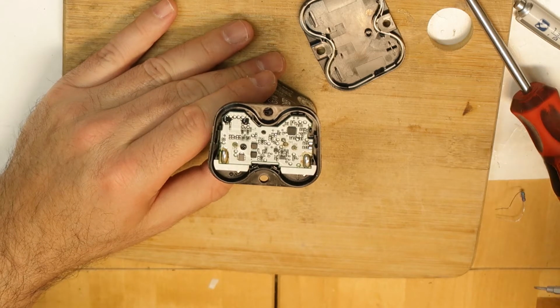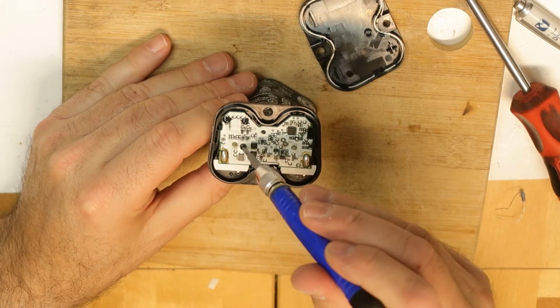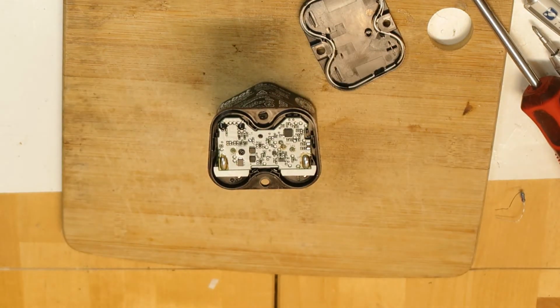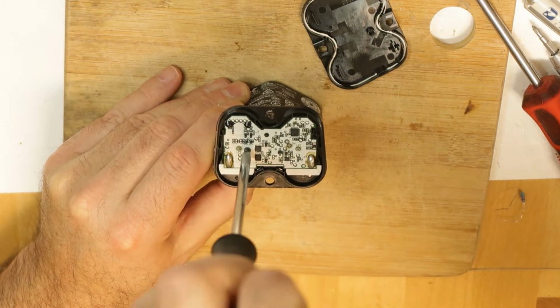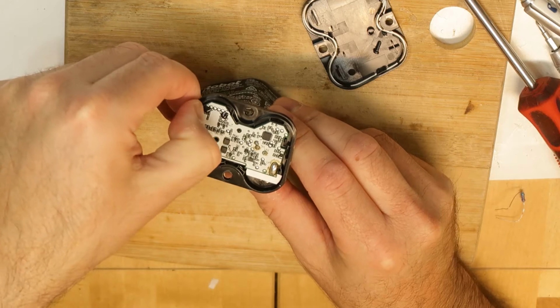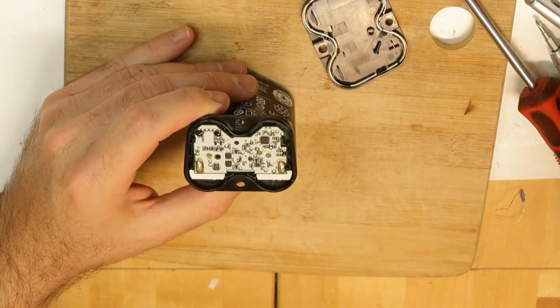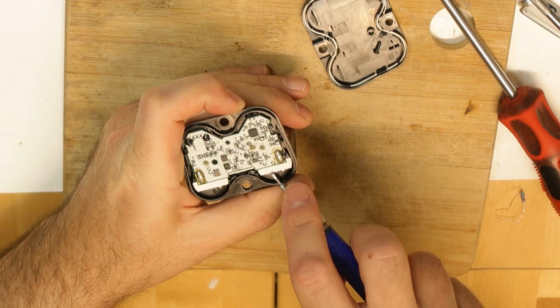So if you notice very closely, it's my first time doing it, I've never done it and I'm not familiar with this model. There is a tiny Phillips screwdriver here, and this will not open it. So I'm searching for a stronger one. Yes, this will do the job. Of course, be careful not to short, as I don't know the condition of the batteries. There are some clips here, probably I can pull it out, but I want to be very careful with the short. Maybe I need to discharge the batteries first.